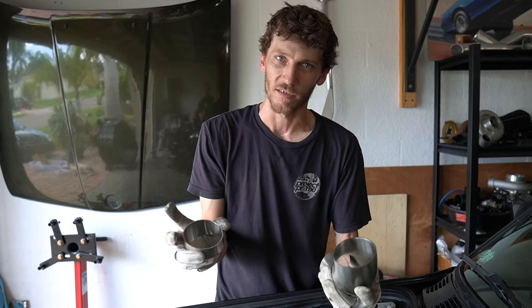I'll check that and make sure the face is where I want it with the V-band, do a little stub-out to make sure it clears underneath the car everywhere, then get that part welded out with the V-band and that little degree. Then we'll start working on the wastegate and getting that thing recirculated back into the downpipe. So far everything's going good — good clearance on everything, working out just how we planned.